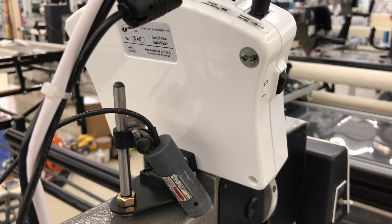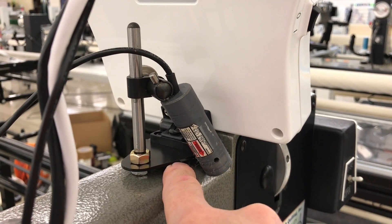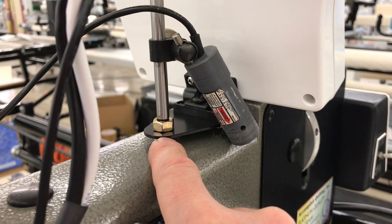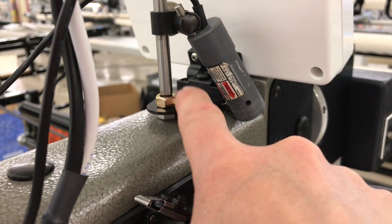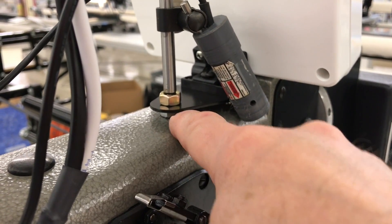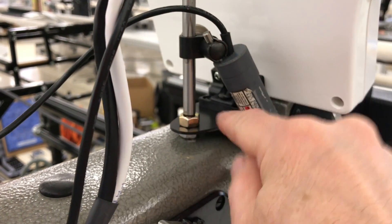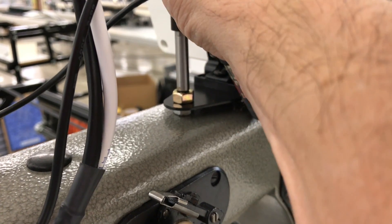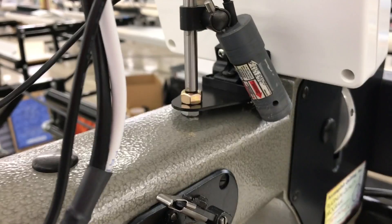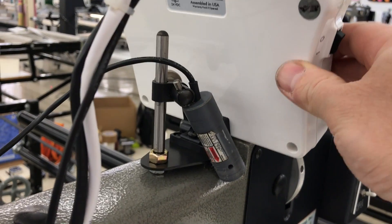Next, we mount the Q-Bot head itself. The Q-Bot head has a bracket that mounts to the post on the machine. To do that, remove the post by loosening the nut and taking out the post. Take the nut off the post, spin on the nut that comes with your kit, put this assembly through the bracket, and put on the nut loosely so you can still spin it in the bracket. Then re-thread it into the top of the machine, tighten the nut downward to secure the post into the machine, and tighten the top nut to clamp the whole assembly. The Q-Bot head will then be securely clamped.